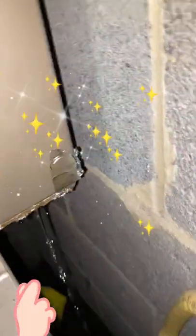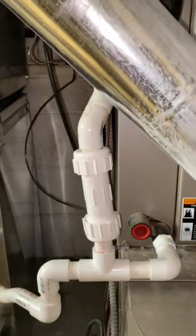The power is running but I still didn't see the leak yet. I found the leak — there is another leak here too. This one is overflowing; it takes a while and then the water goes in there and drips into that area. As you can see, the water is still up in here, it's dripping very slowly, which means this drain is clogged.